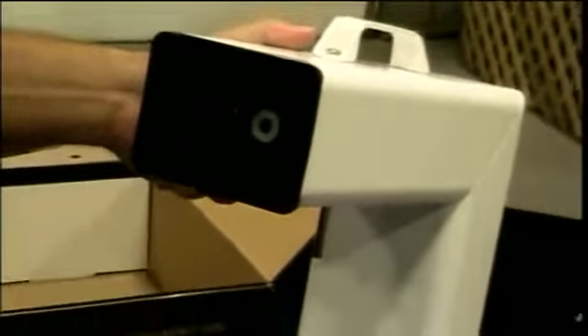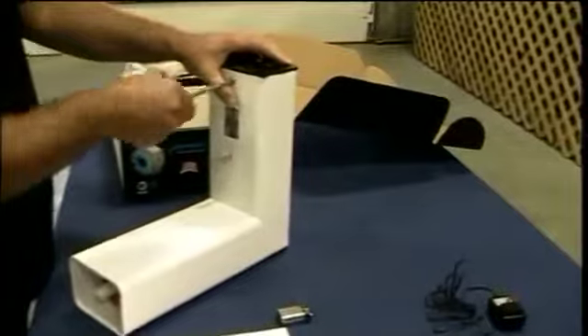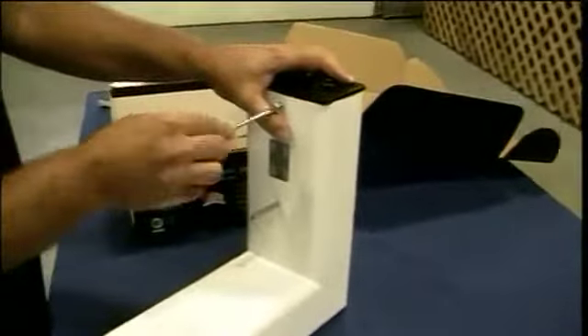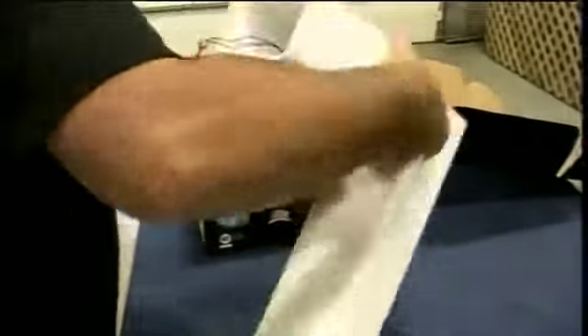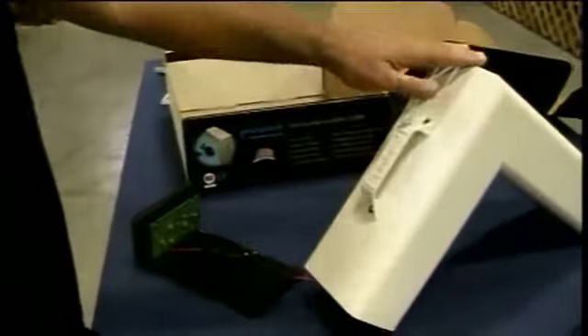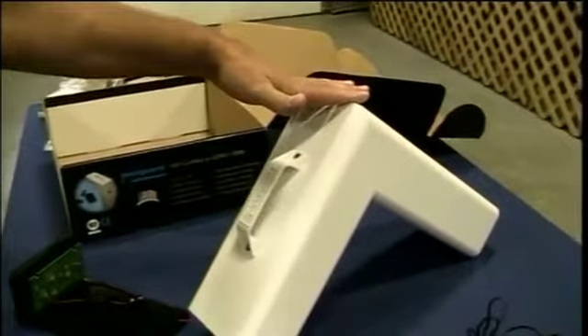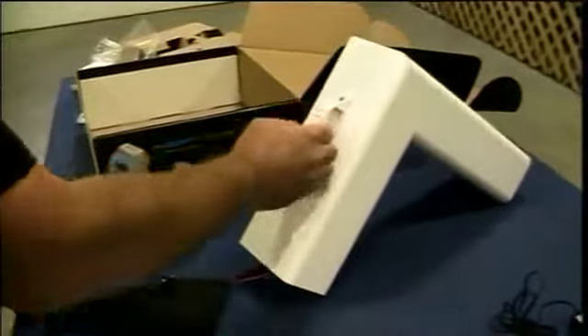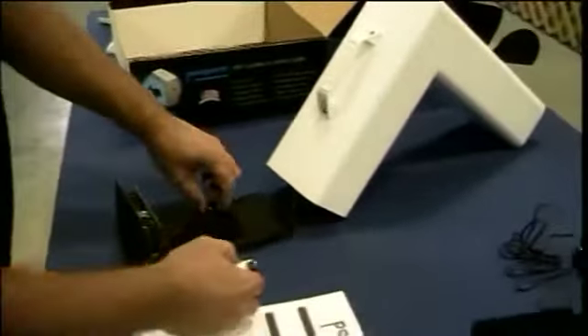Let's go ahead and install the nine-volt battery, which is what this unit operates on. Take out the foot screw — this is a Phillips — and pull out the electronic assembly. Set the alarm in the upright position; when you take the alarm out of the pool, keep it in this position. When the battery is connected the alarm will wake up and go off, so you'll need to hold the key for about three to four seconds to put it to sleep.